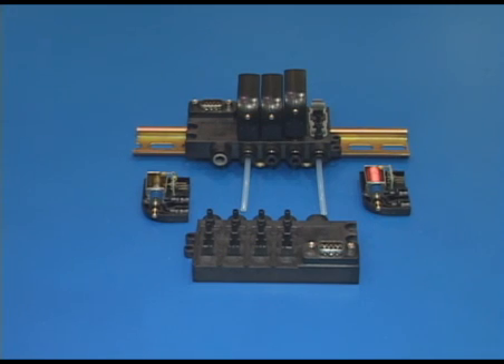Today we're talking about the fourth iteration of Isonic Technology. Isonic Technology is basically a new way of manufacturing valves — instead of machining any particular material, we're molding two half shells, dropping the components in, and ultrasonically welding.